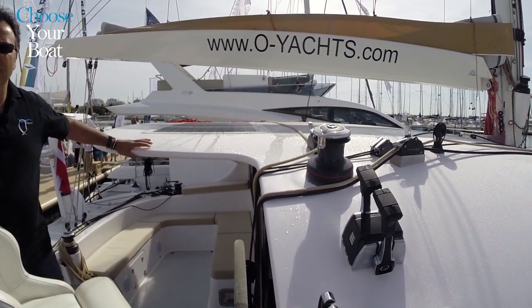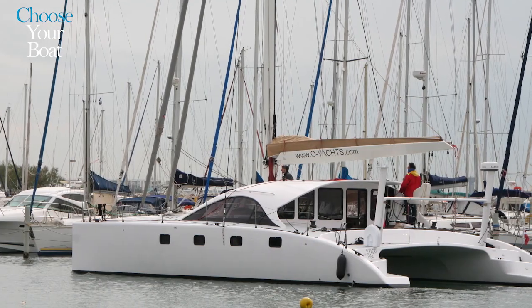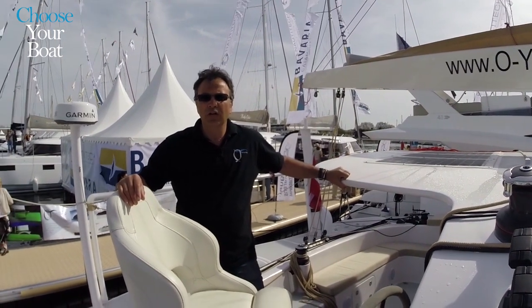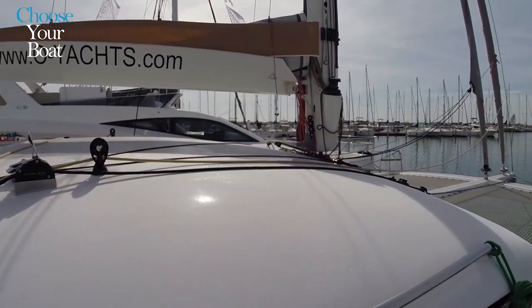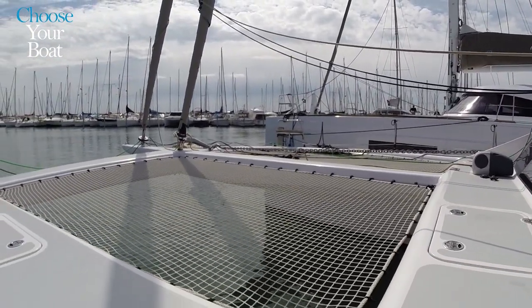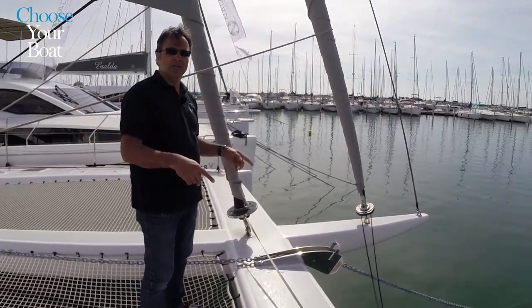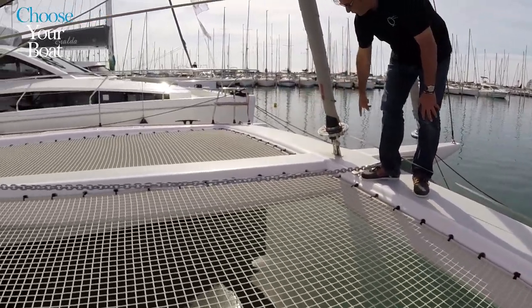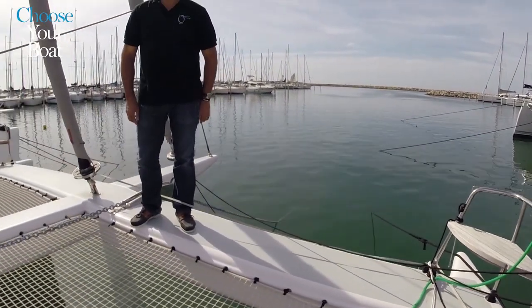The main thing regarding O-Yachts is really safety first — this is for us the main argument. For safety, we have a few solutions. The first solution is strength; the boats and yachts are made to be extremely strong. For instance, we will go to the front and you will realize the building is quite different there. Usually you find a front beam that is a piece of aluminum and it's bolted, but in this O-Yachts, the whole cross is carbon — 11 pieces of carbon, everything hand-laminated, not bolted, to make the boat solid as a rock.